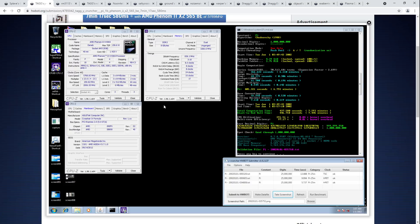This sounds great, except there are drawbacks because a lot of the time the cores are disabled because they actually suck. I've had Phenom 2 X2s where you enable the extra third core and the chip is no longer able to get into Windows because that third core is just completely unstable. Or there are chips that just don't enable extra cores whatsoever. Then you have chips where the third core clocks half a gigahertz worse than the rest of the CPU, so you lose a bunch of frequency.